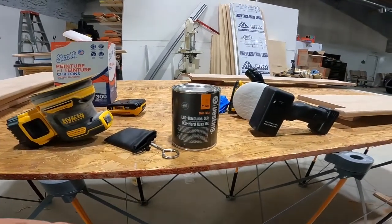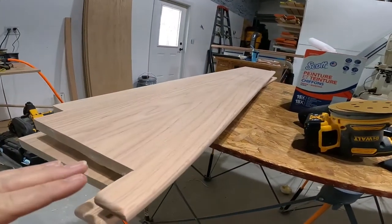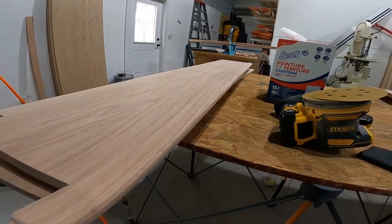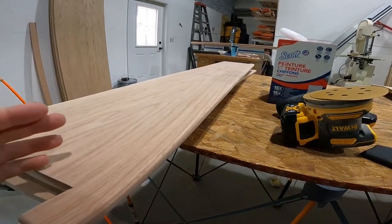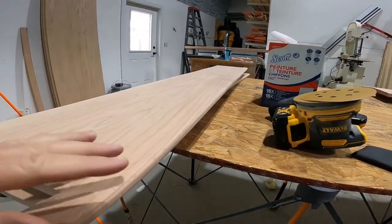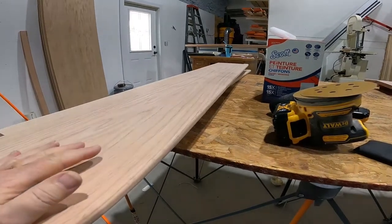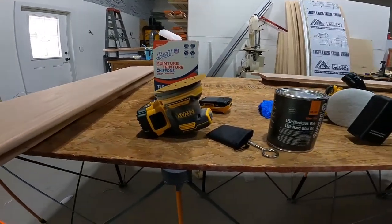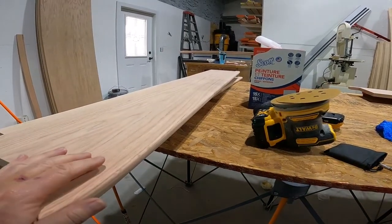And what's different about it is, as you're well aware, when we apply stain, we go with the grain and then let it sit, wipe it off, reapply if necessary, let it set, wipe it off, and then let it dry. That's just the stain portion, then your poly or whatever other finish you're putting on goes on top of that, plus its time allocations and requirements. But with only going to a 120 grit, you're done with your sanding very quickly.